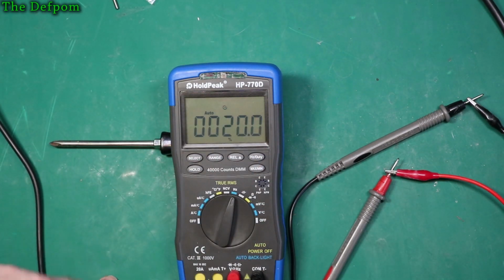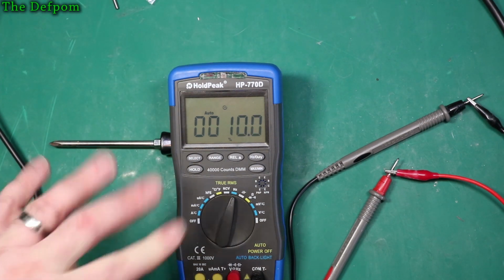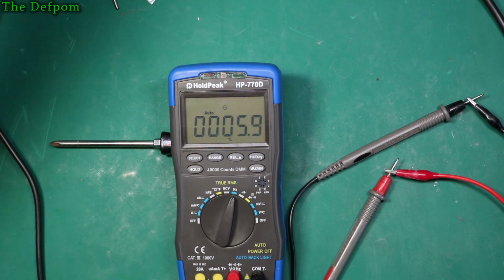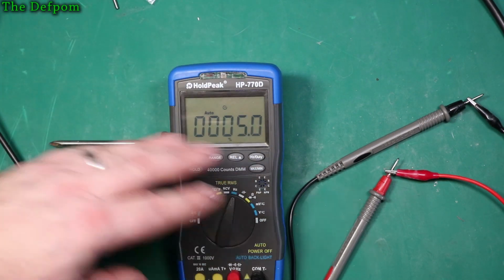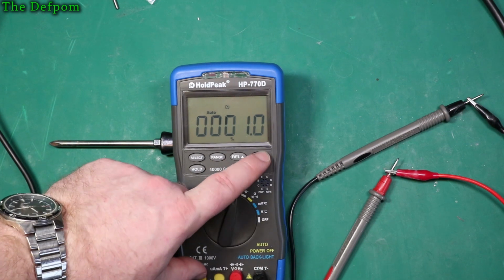So it's about thresholds there. I can see 20%, it's 2 volts. Let's do 4%. No, it's dropping out. 10%. I'm on 11% right now, sorry. 10% is there. Okay. Let's give it a little bit more voltage. 2.5 volts. Duty cycle 5%. Yeah. So it just needs a high enough voltage to get that threshold so I can actually see those short pulses. 1% duty cycle. And there we go. And that's at 2.5 volts.